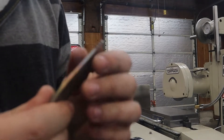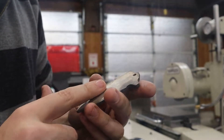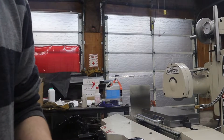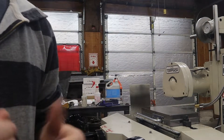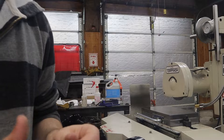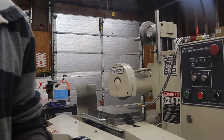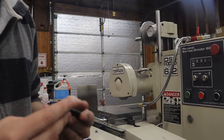What I do is surface grind the part that came from the factory flat. I buy the material just face-ground or face-milled. I'm going to use this side and put it down on the chuck. Basically I'll clean one surface up nice and perfect, then measure it, flip it over, and grind to final depth. That's how I've been doing it, and the results have been a lot, lot better than trying to face on the mill — spectacular results, really. Within a tenth over the whole three inches, which is making me really happy.